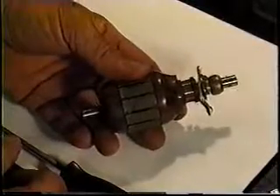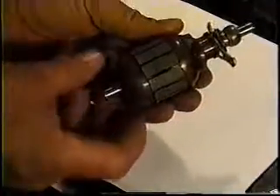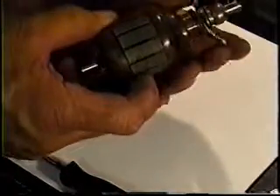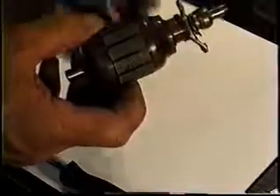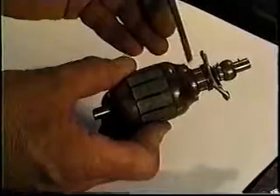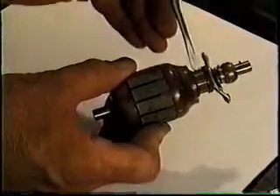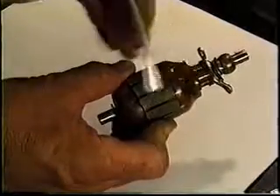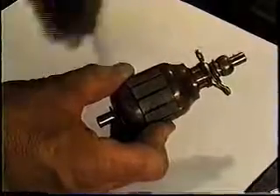We referred to the fact that water is your biggest enemy. This is the actual electronic rotating portion of the electric fuel pump. Now obviously I've dissected this and there's some pieces hanging off of it, but the part that's most damaged is right here. This is where the electrical contact occurs with the brushes. There are two brushes which mount on either side of this and conduct the electricity to form the magnetic fields that make this spin.